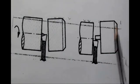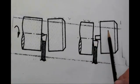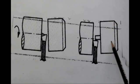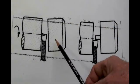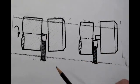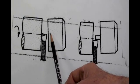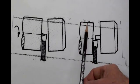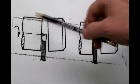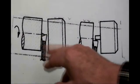When you grind the end of your cutoff tool, normally we grind it perfectly straight across. But when you grind it straight, quite often the piece will come off the lathe and a small tip will be left on the remaining piece. If it's waste stock you don't care, but on turret lathes making tens of thousands of pieces, we always ground the tools at a little angle so that as you feed in, it completes the cut cleanly on the usable piece, faces it off, drops it away, and then removes the tip from the bar stock too. Grinding at an angle means both pieces have the tip removed.